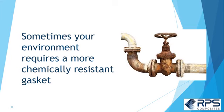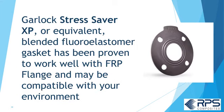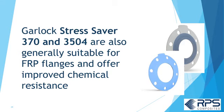Sometimes your environment requires a more chemically resistant gasket. The Garlock Stress Saver XP or equivalent blended fluoroelastomer gasket has been proven to work well with FRP flanges, and it might be compatible with your environment. Garlock Stress Saver 370 and 3504 are also generally suitable for FRP flanges and offer improved chemical resistance.